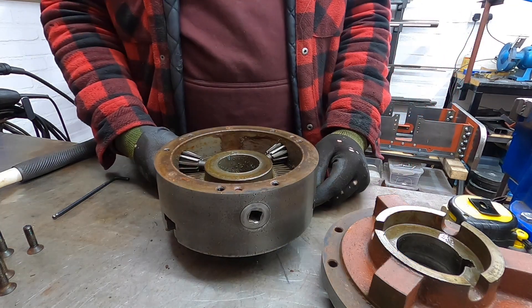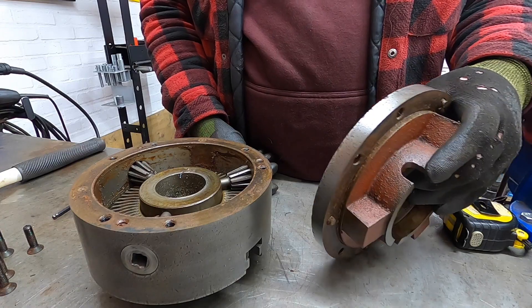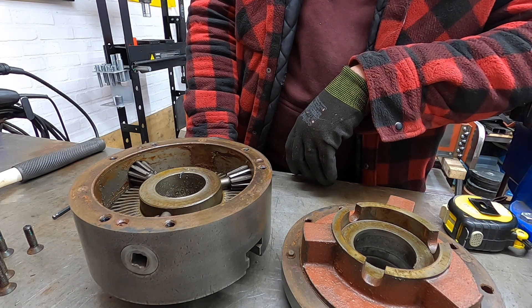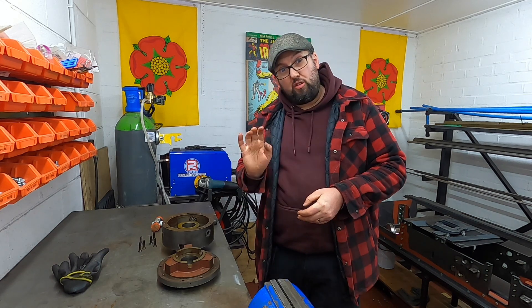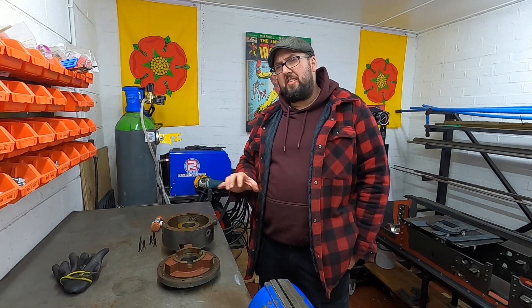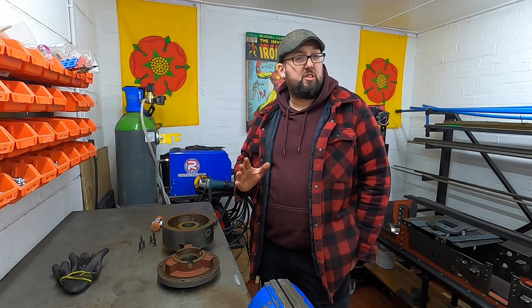Unfortunately, my plan is not going to work because I thought this would just be a back plate that we could use on another chuck. So we are going to have to come up with plan B, or C, or D. Plan A hasn't gone to plan — I thought we'd be able to use that as a back plate and we can't. There's too much there to machine off, and then there'd be too much sticking out to bolt another three-jaw chuck on. So we have to go through the entire alphabet until we find a solution to get an operational three-jaw chuck on the lathe that doesn't add deflection when we're cutting.